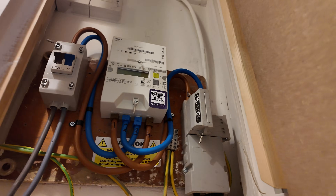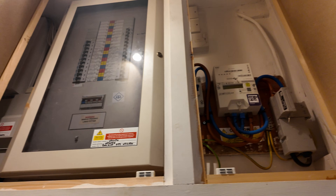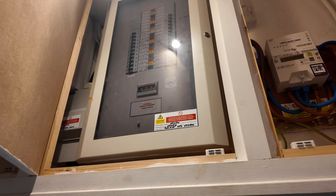At the main intake you can see we have our supply here — it already had a nice isolator in position. It's a three-phase board that has been converted to single phase, and we've popped our little switch fuse down the side, which has our sub-main going off to the gateway location and tapping through directly into the distribution board — no singles on show anywhere. The basic principle is power is taken from the meter down to the gateway and then returned back into the house consumer unit, which keeps the lights on when the grid goes down. I hope you've enjoyed a look through this system — if you're a customer looking for something like this, please get in touch. Massive thank you to our customers on this one, and to Matt and Nathan for another great install. Drop any questions in the comments below and we'll see you on the next one.